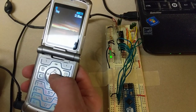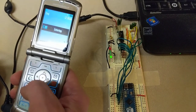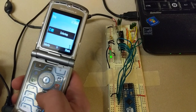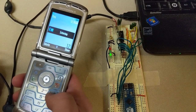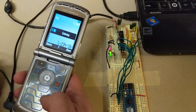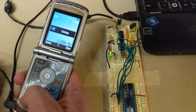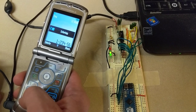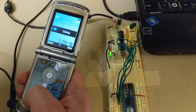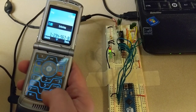For a quick demonstration, I'm going to push some buttons and watch the LEDs — you can see them flash. What's happening is that when I push these buttons, it sends that DTMF audio tone into the circuit, which converts it into a 4-bit binary code. Each key has its own binary code associated with it.